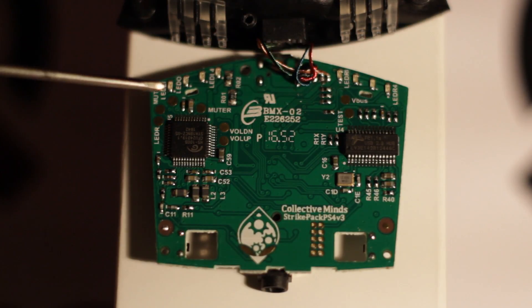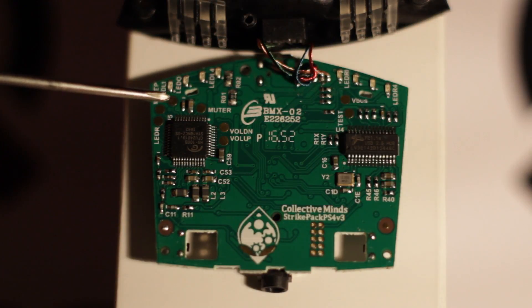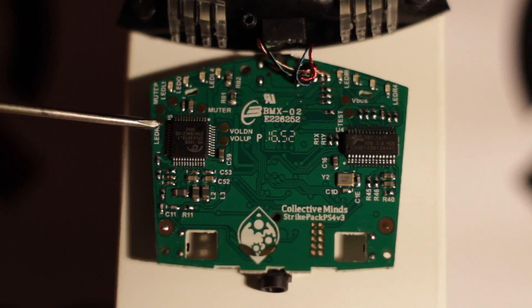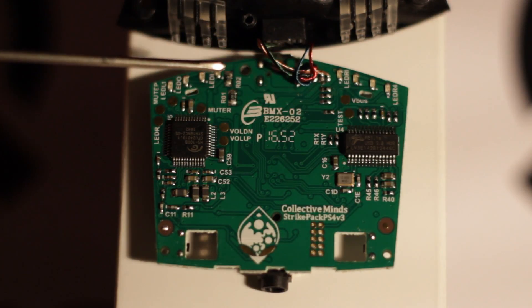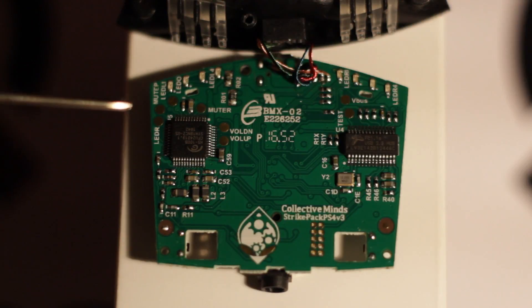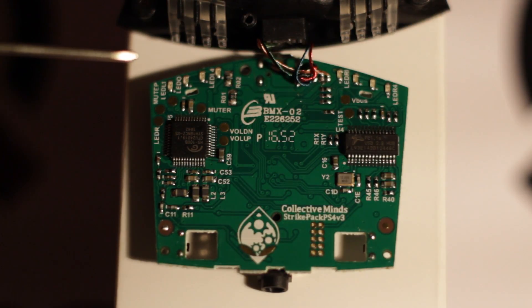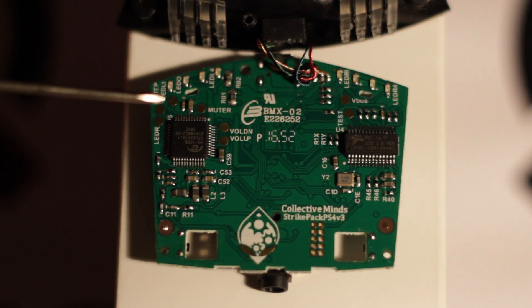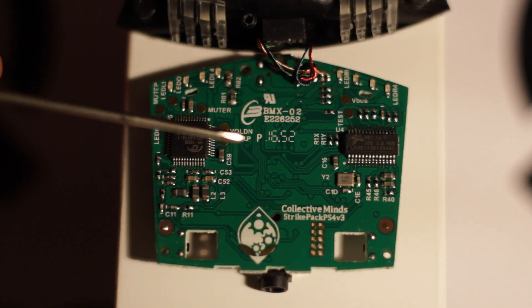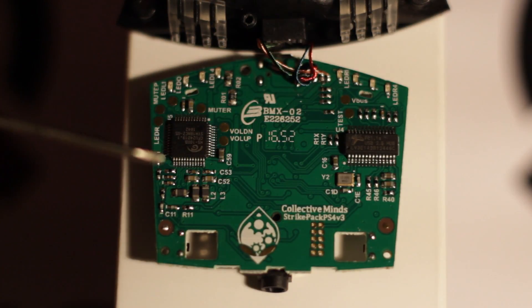This is a dual DAC as well as a headphone amplifier and microphone input. It's USB and SPI, but my guess is it's just going through the hub and enumerating on USB — the SPI might still be used, and upon boot it's probably configured by the STM32 to set the headphone gain and other settings.